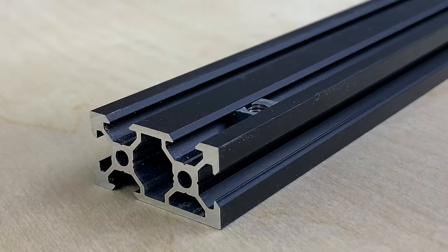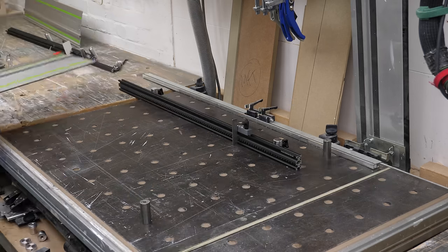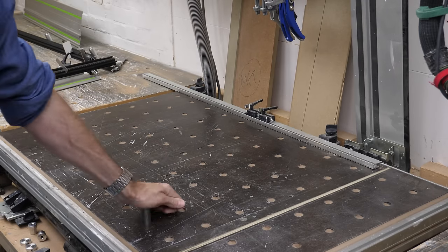Of course, with both the rail dogs and bench dogs options, you can always add a fence to this setup. The bench dogs' fence dogs are a great solution to this, as they make it easy to add and remove the fence complete with flag stops, so that you can interrupt your cutting session to clear the bench if you need to, then get back to it knowing that your cuts will still be accurate.